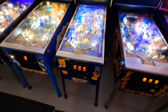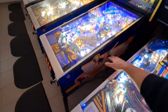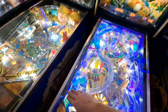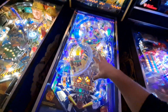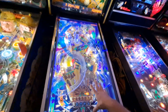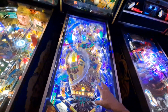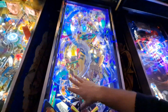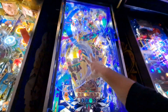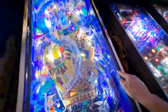Radical — excellent game. I'm so glad I found one. This is one of only 1,300 Radicals made by Bally. The side art is in incredible shape; it's got this neon orange side art that really glows under a black light, and I have black lights in this machine. This was also a basket case when I got it — it was in an old storage warehouse in Berlin. I got it for a good price. Had to strip everything off, remove the mylar, and I lost a lot of inserts. I had to get an insert decal set from Russia to get that installed.